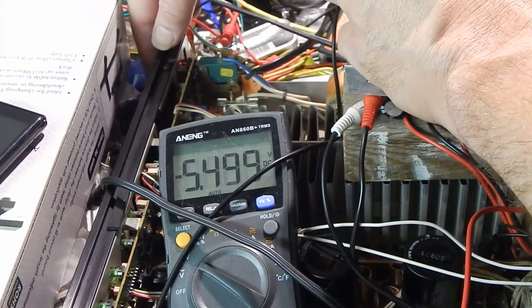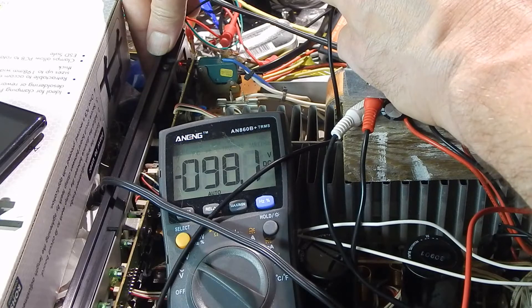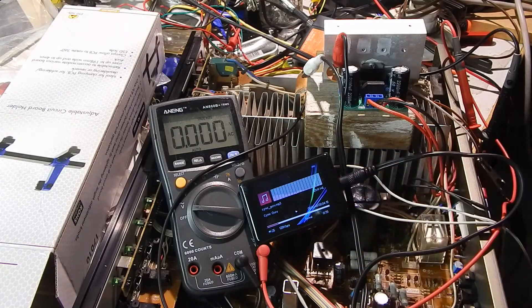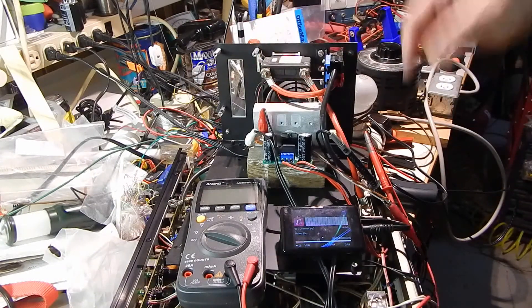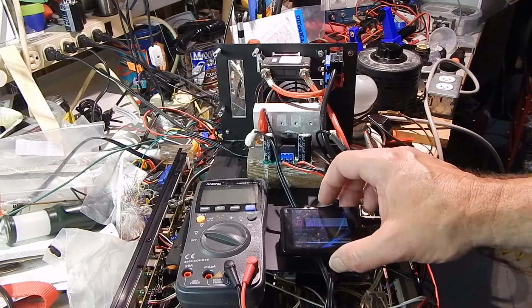It's difficult to get a voltage reading directly off these caps - this is a rail to rail 98 volts. My MP3 player is charged up again - I'm going to see if I can get any more output from that. I wasn't able to drive the unit very hard with the netbook. This unit is working fairly well - it gets nice and hot. I've put it in front of a fan - this heat sink is undersized like I said. I have it set up for 4 ohms now. It turns out my other speaker isn't burned out - one of my alligator clips burned out. So right now it's hooked up to 4 ohms.